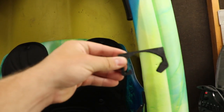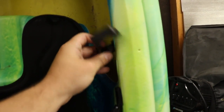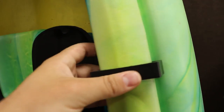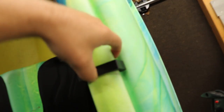To give you an example of what an earlier prototype looks like when testing — I was looking for something that would hook under the bottom side, go over the top of the contour, and fit. But as you can see, this one is very loose, so I had to go back and design tighter tolerances. You can also see in the contour that it wasn't fully hooking like I wanted, so shrinking it down and designing a better hook that grabs underneath should do a lot better. Let's see the final result.